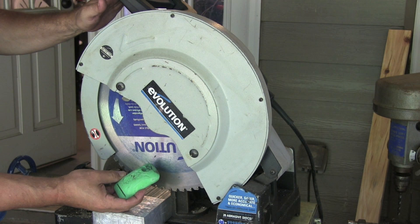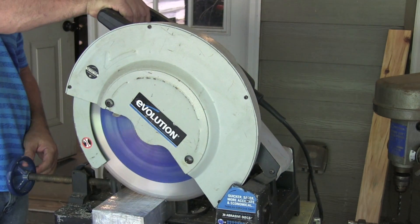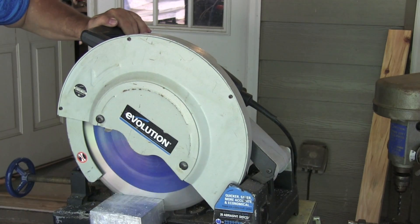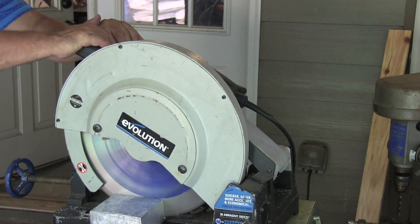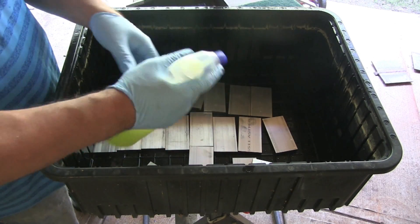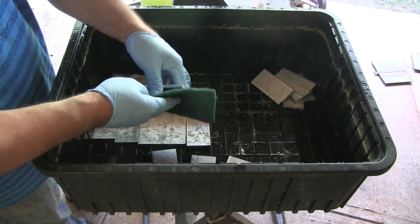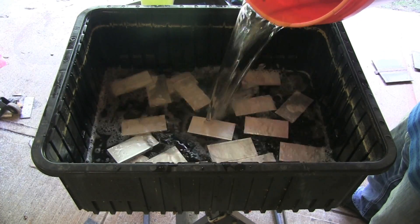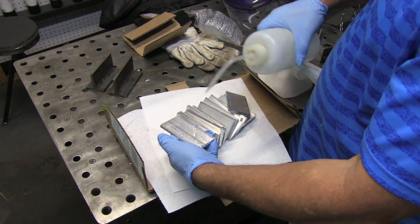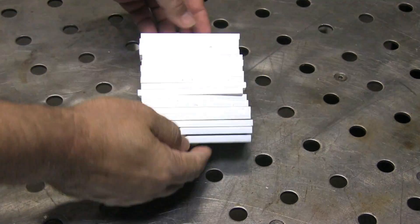I'm going to be cutting up some quarter inch thick aluminum here and I'm going to be using this Irish Spring bar of soap to keep my blade cool and lube it a little bit. I like using soap for lubrication on aluminum and a lot of other metals for drilling holes and things like that because it washes off really easily — it's water soluble. I'm also using this aluminum cleaner from Dynaflux. I scotch-brited it pretty good, rinsed it off, then a little acetone and a wipe down, and you can see it's pretty clean metal now.